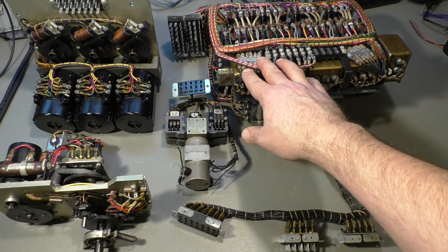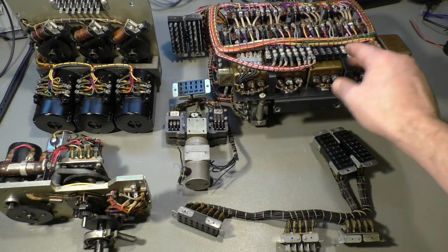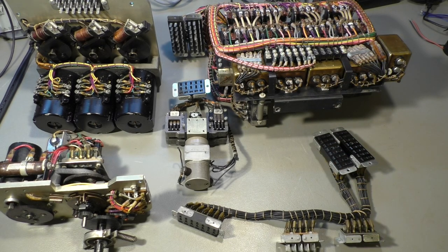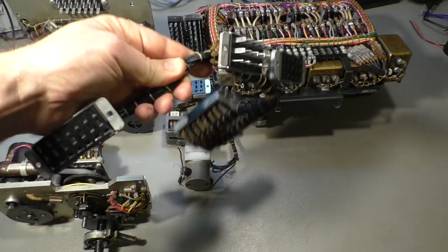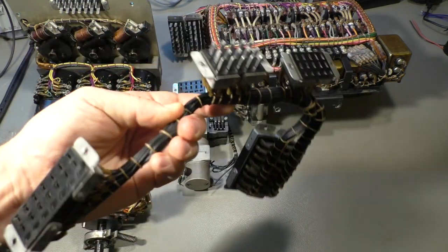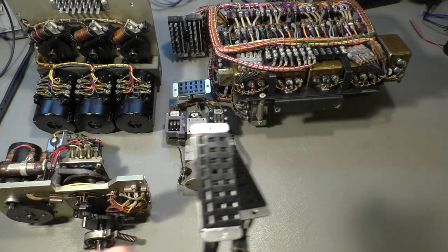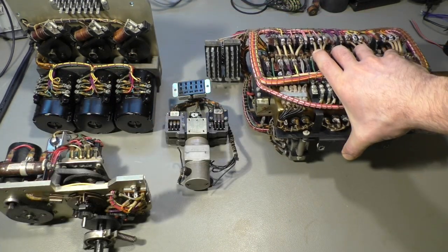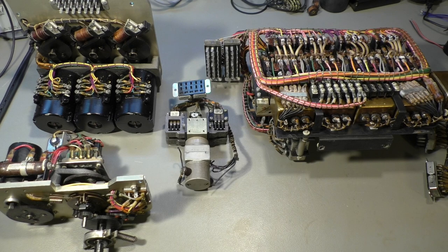We have a little bit of corrosion here. You can see all this white gunk here, that's from moisture. That's the cable tree inside with the connector for these individual modules here. Now, before I start, I should explain what a propeller synchronizer box does.